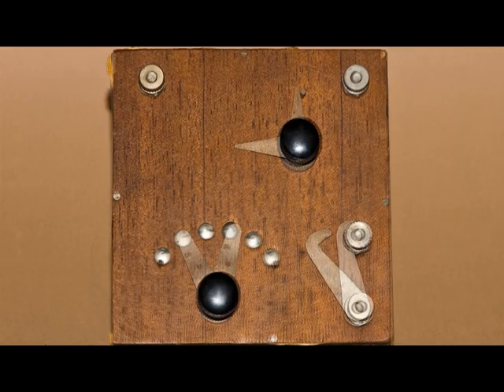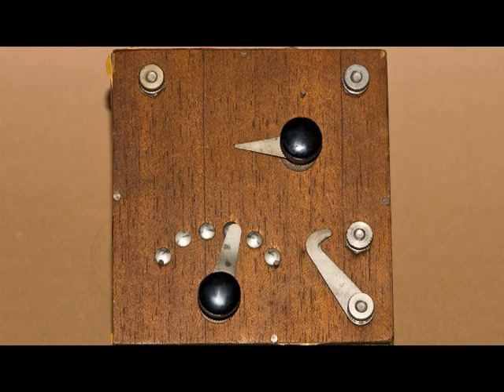Here I have moved some of the controls and connections, and at the upper left, that terminal at the top doesn't seem to be connected to anything. I can get continuity every place else, except there.